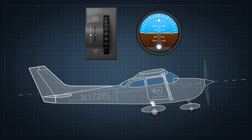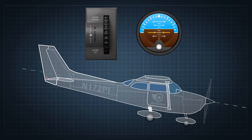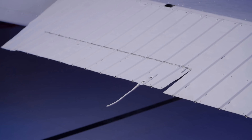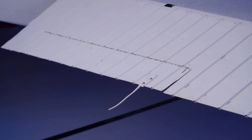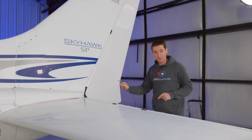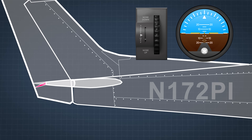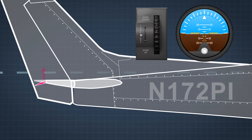This is a game changer because it allows the pilot to focus on many other tasks without having to worry about the attitude changing when they reduce or increase pressure on the control yoke by mistake. The trim system can be as complex as a movable trim coupled to an autopilot, or it can be as simple as a flat sheet of metal that is bent in place on one side. In either case, the basic idea is the same: redirect the airflow to place the control surface in position and keep the airplane in the desired attitude.